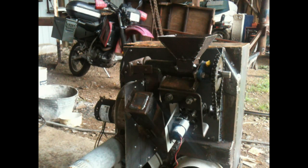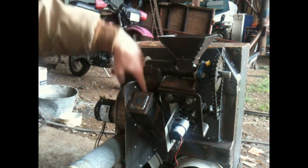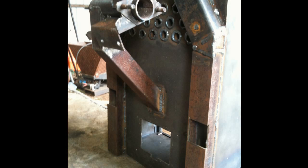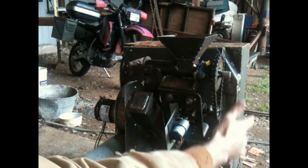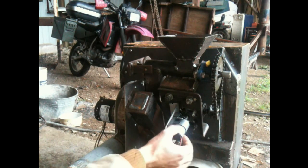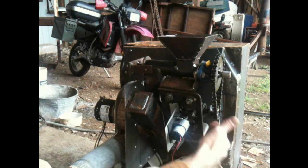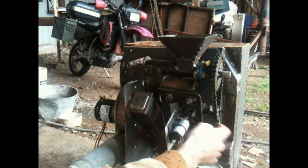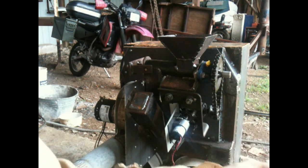Okay, the design of the auger: that's a feeding column, that's a traveling space, and over here it's falling down by gravity into the stove. On one side I have a huge three-quarter inch bearing which takes all the stresses of the gear reduction. Over here the motor is totally separate with two sprockets, one connector, and the angle transmission is out of the grinder so it's only turning one direction.